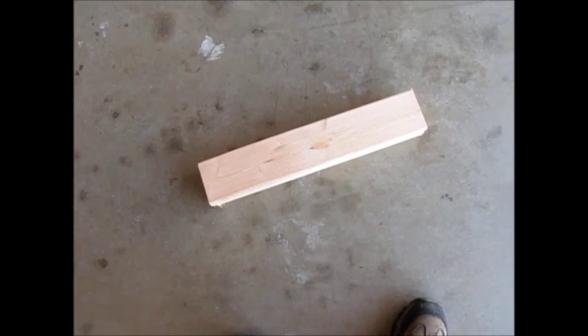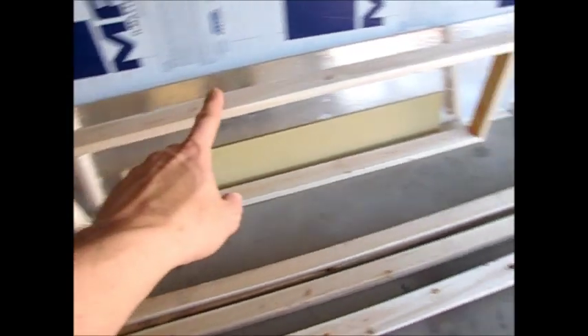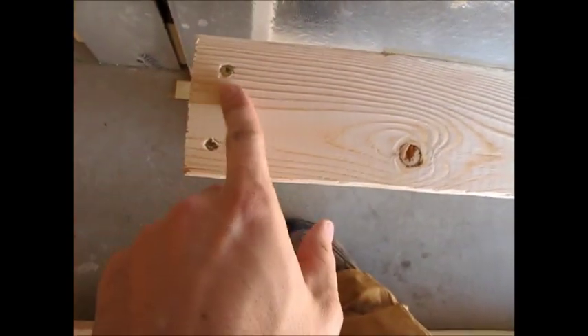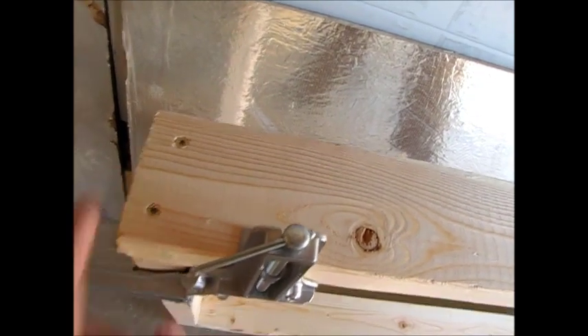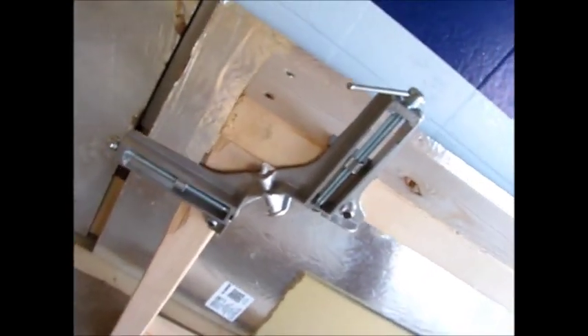We're going to put them into a frame like this — here's the 18.5-inch piece and then we've got a 74-inch piece. That's going to make the sides of the bed. You just need some 2.5-inch screws, and you'll probably need to use a 90-degree clamp to make the corners as nice and neat as you can. That helps immensely so you can hold this in place while you drill the screws in. Those are 2.5-inch screws so it can really make a nice connection.